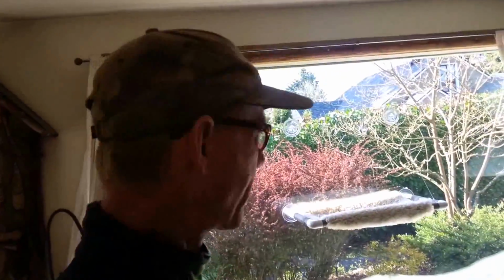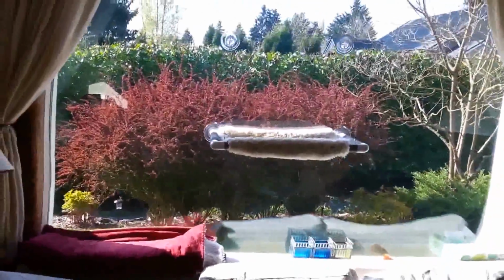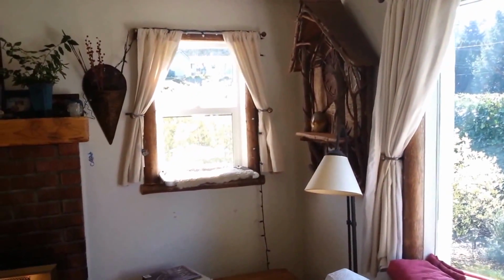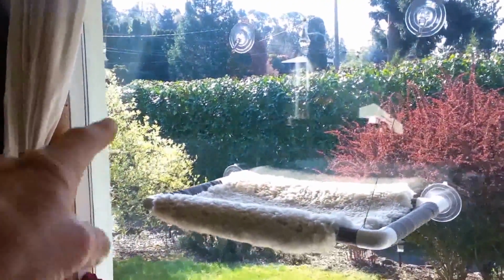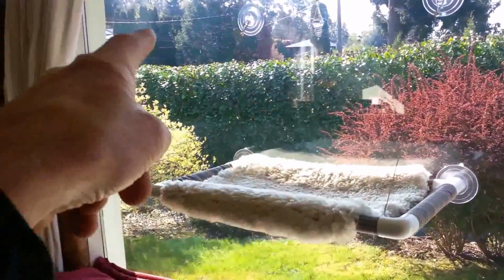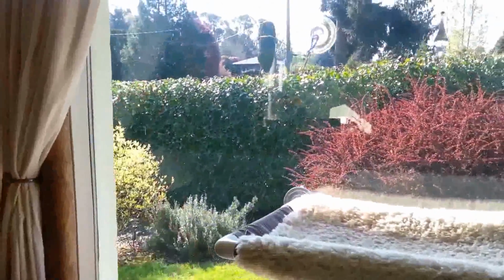And what I'm going to do here is take the window out. I'm building my own bay window, so I've already bought the windows and stuff, and this window comes out, and then I'll frame it out. There's going to be a 4 by 4 picture window right in the center, and then I'm going to have two of what they used to call double hungs, though some call them single hung, so we'll call it a single hung for this purpose. So there'll be a 4 by 4 piece of fixed glass, and then a double hung on this side and a double hung on that side.